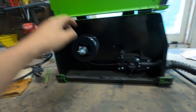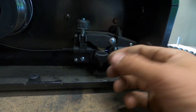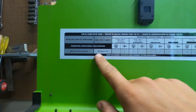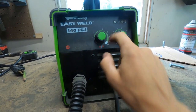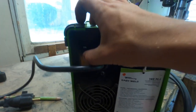You open up the hatch and put your wire in here. Under here you have a little roller — one side has a groove for 0.030 and the other side, flip it around, for 0.035 wire, and you can run either one of those. Up here we have the setup chart that shows you the voltage and wire speed for each thickness. The display is nothing fancy because it's just a $200 welder — it's analog, showing a dial of 1 to 10 for your voltage and 1 to 10 for your wire speed. Nothing fancy on the front. Then lastly on the back you have your power on and off. It's a pretty basic machine, but it gets the job done for sure.